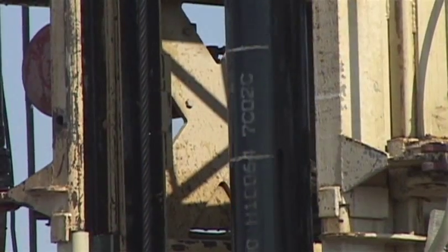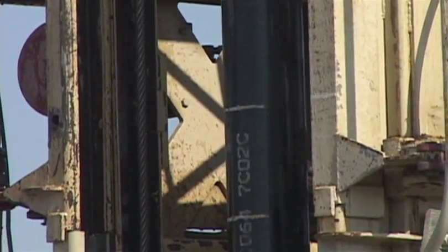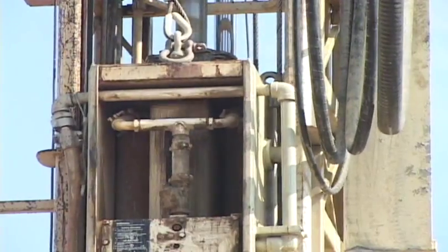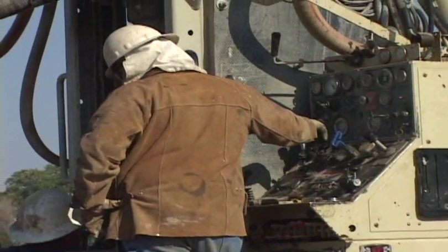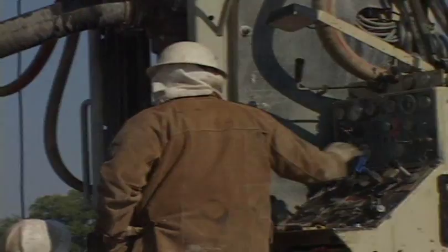As the drilling progresses, the casing advances. With precise operator control, the energy output of the hammer and number of blows per minute can be varied to adjust to the geological formations encountered below the surface. A single mechanical valve controls the air distribution. A simple adjustment to the casing hammer and removal of the top anvil collar will allow updriving for casing withdrawal.